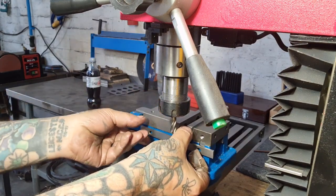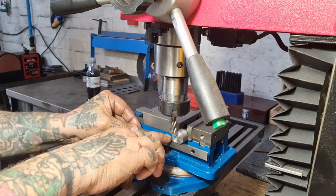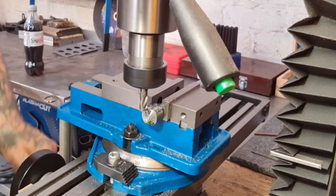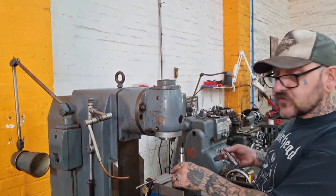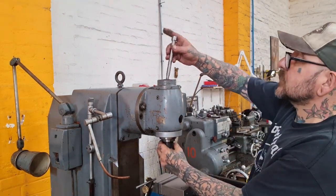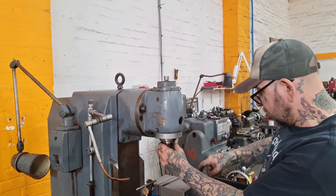I've masked the camera with my hands, but you squeeze it tight basically and look along the length - you can just eyeball it on the bottom of the vise. That's good enough for a bolt, and that's the second side done. Used a bit of oil on the finishing cut. We'll get that cleaned up and over to the big mill. So now I've got one drawbar, one collet chuck or collet holder - drop it in there and tighten down.